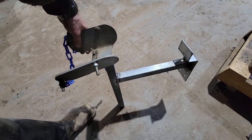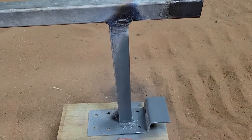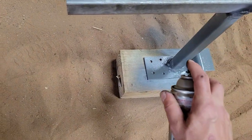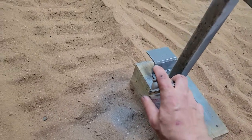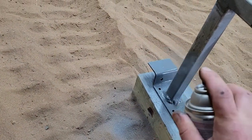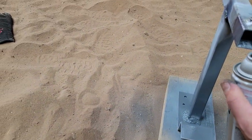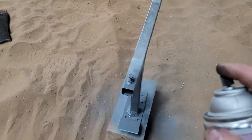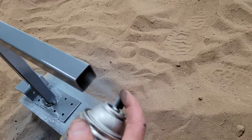This headpiece would be easy to make out of steel if you needed to. I'm going to spray it with cold galvanization because I don't have hot galvanization, but I like galvanization — it seems to hold up better than a lot of things that are painted in the barn. This cold galvanization stuff really holds up, and if I put that down first and then paint it, it just holds up so much better. So I'm going to cold galvanize the whole piece, and once it dries I'm going to weld a little bolt across the top of the nut so I can tighten it with my fingers instead of a wrench.